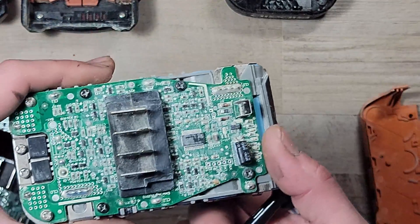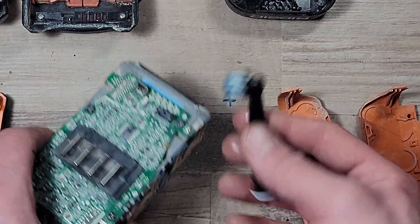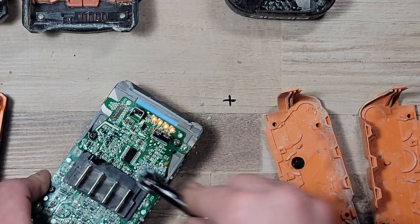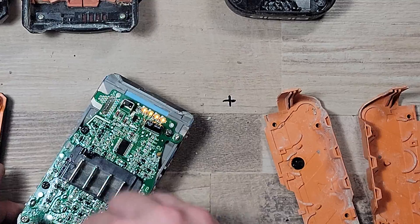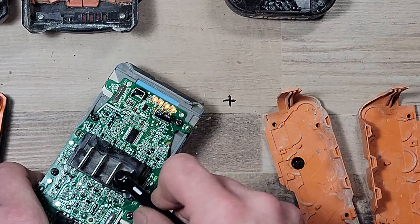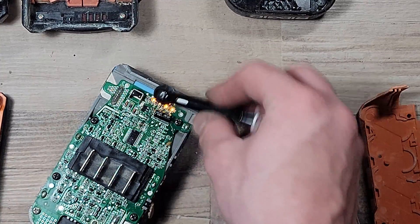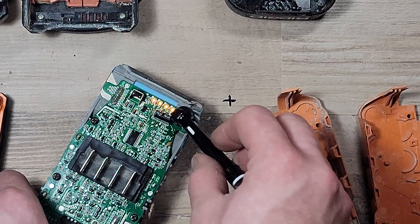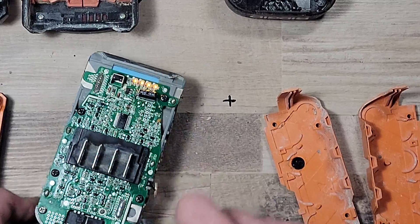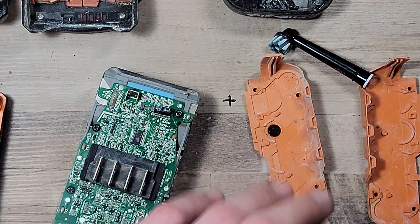Going the daredevil route with 99.99% isopropyl alcohol and scrubbing — you can see the indicator lights turned on while cleaning. That's actually an indication of conductivity in the alcohol, suggesting there may be some water in the solution. It could also have been from physically brushing against a resistor. Either way, the lights staying on suggests water contamination in this alcohol, which did come from the dollar store. Let's see if that scrub-down solved the issue.